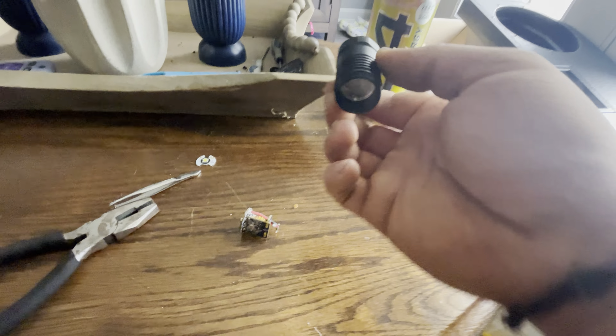Positive, negative. It sits like this up through the head of it. You got to flip this around like that and it'll lift just like that. I just desoldered it from the board in there — there's positive back there and negative right over there in that corner. And then you just take the LED out. On the bottom, once you got that little piece off there, you can pry with pliers right there on that needle. Just grab it with the pliers and walk it out — be easy with it. It'll come right out. This is not glued, or if it was, just a little bit. I just wiggled it out and it comes out.